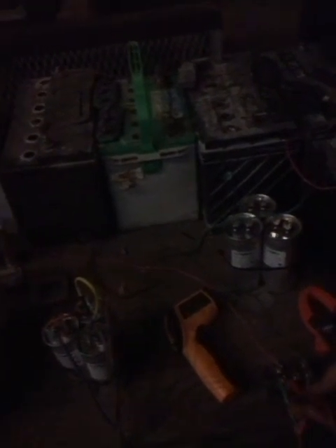All of this is currently being run by an inverter hooked to the grid running at 120 volts, currently drawing 2.1 kilowatts. We are going to set up a 200-volt system so that the inverter runs off the batteries hooked in series at 200 volts — usable down to 180 volts. The three-phase motor can charge at up to 480 volts; it's currently wired for 230. Because the battery is acting as the voltage regulator, we are only putting out 45 volts AC three-phase.